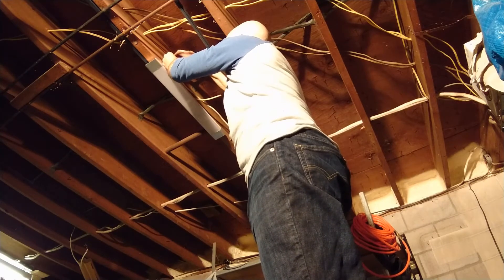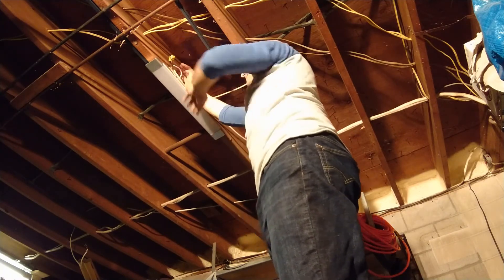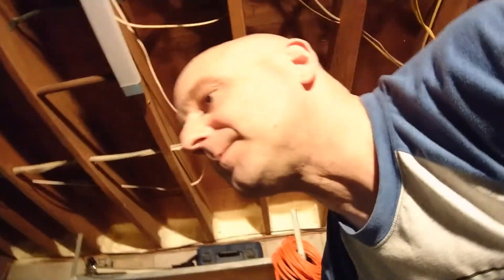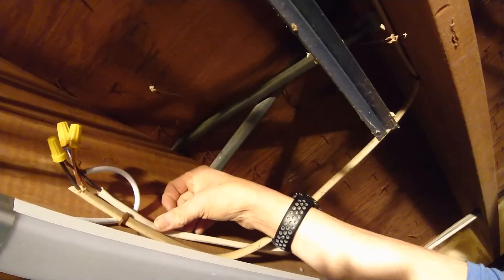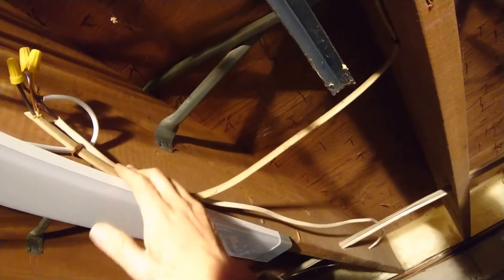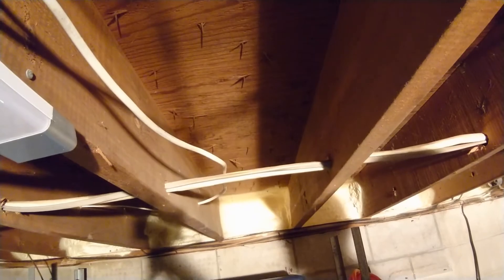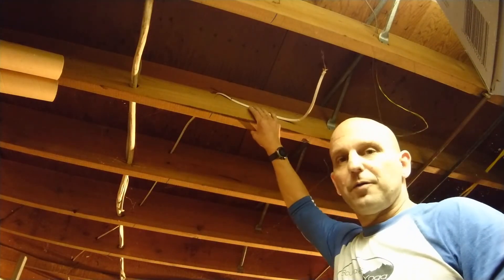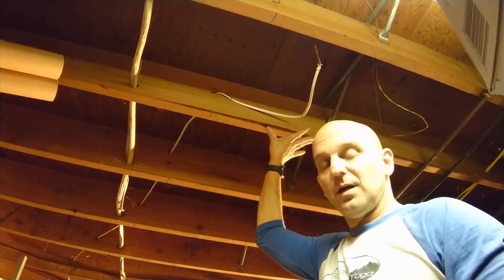Test all of them - make sure they're snug and tight; don't want anything coming loose. That wire we just put in is not included in the staples, so we'll put a second staple in so that if anything moves it won't affect the connection between these wires. I'll put a staple here and another staple down there close to the hole. Then we'll go over and work on the light - run the wire through, put another wire nut where it comes out of the hole, and then mount the new LED in this location. I have all my tools ready to go.